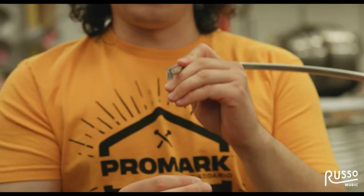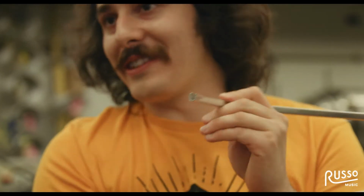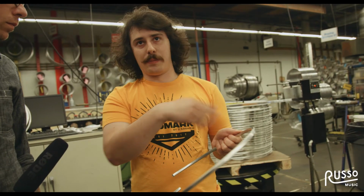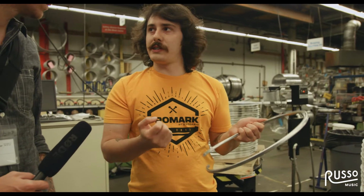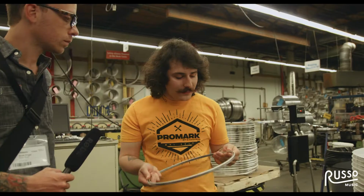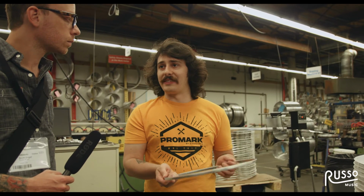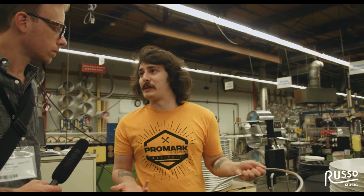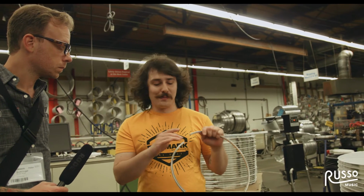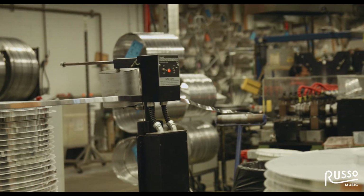We made a very small tweak to the design. If you take a look at the cross-section, it's got a little edge that rolls over, a rollover hoop design. What that does is, when the material is bent and put in and glued, as the glue cures and the drum head's put under tension, that little lip prevents the glue block from separating. With this design change, we're able to get sometimes above 3,000 pounds of pressure, and at that point the polyester film itself will just explode. You won't really ever have issues with the glue block separating. So the smallest change allows us to completely revolutionize the way we make products for certain markets.